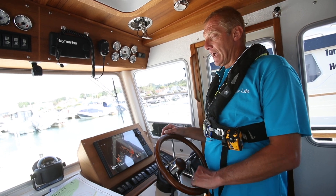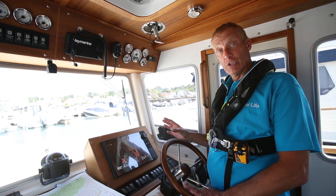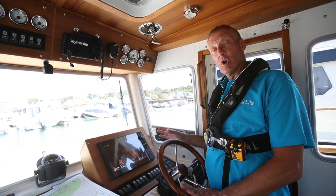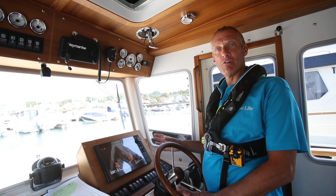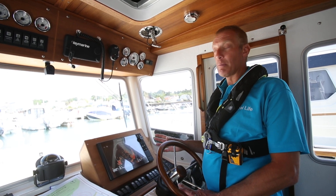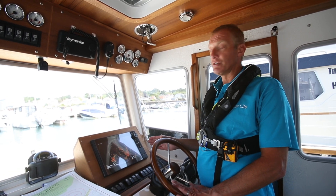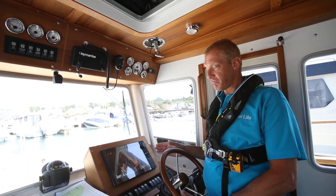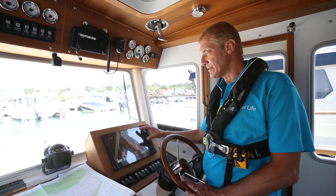When we've got the basic picture like that I had it on auto. Most autos on modern sets are pretty good. However, auto is only as good as the design — so if it's a 10-year-old set you might find the auto can be beaten quite a lot. A good radar operator 20 years ago was much better at setting the picture up than a casual user today. Now the auto stuff is pretty good, but let me show you how we can adjust the picture so you understand what the information does.